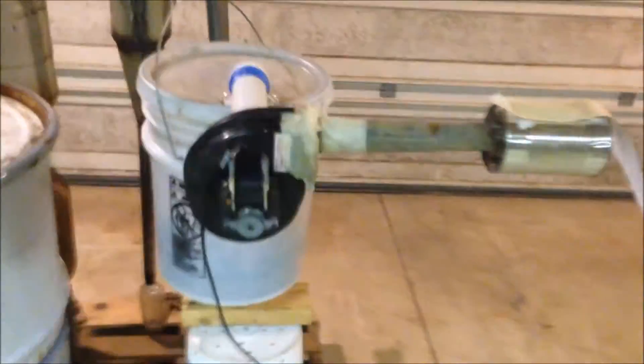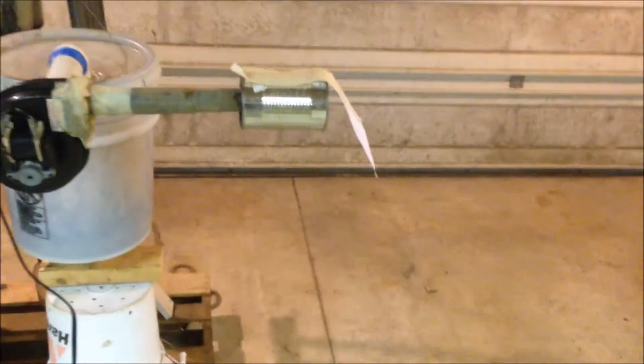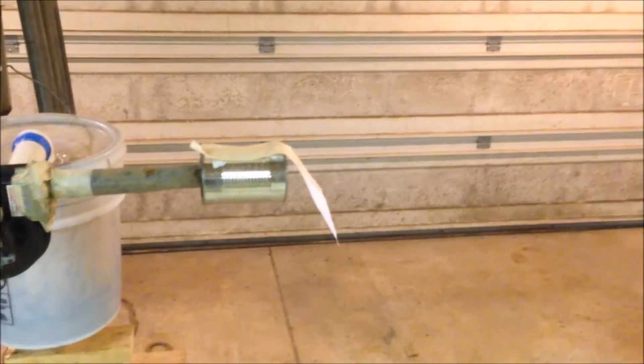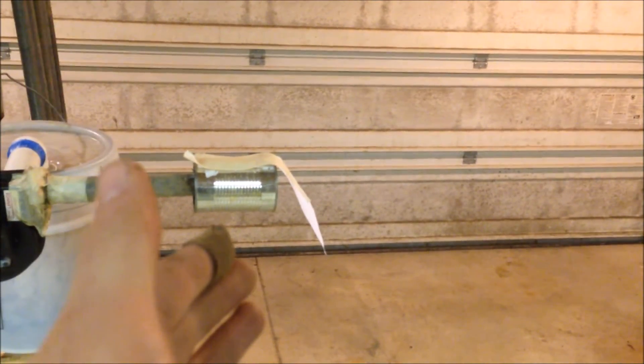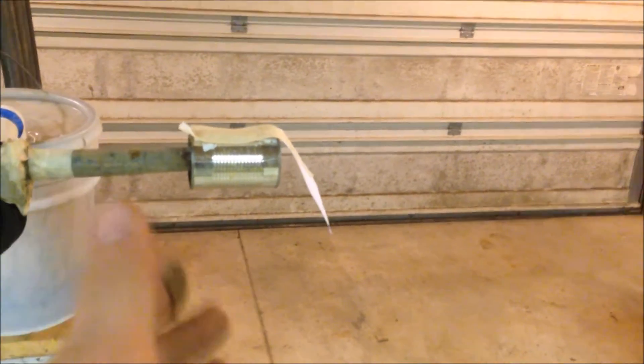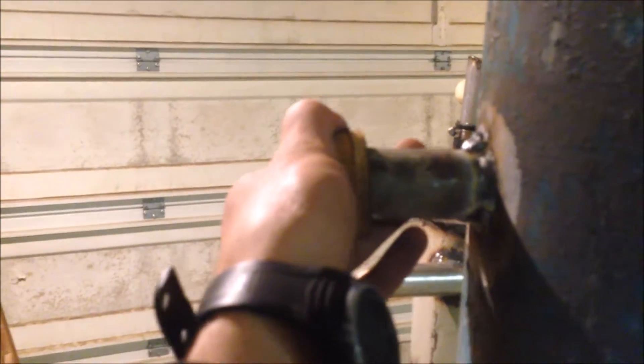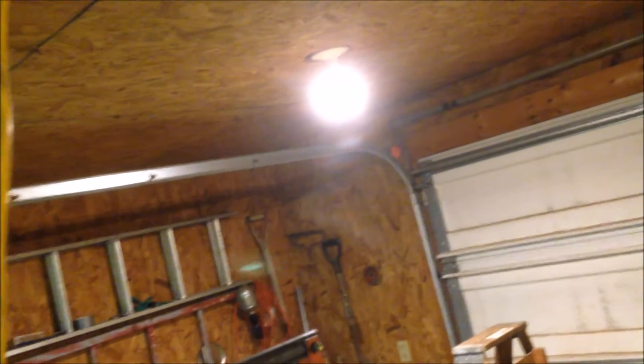The point of this video is to show you what I've done — the radiator is pretty much done and hooked on there. I'm going to show you how airtight the system is. Notice the angle this paper is at right now — it just hangs like that because the tape is stiff, so that's the baseline angle with no air. I believe I have my gas valve shut — yep, it's tight. Going to plug this in and see if my system is airtight.